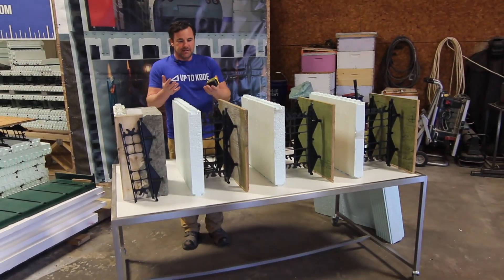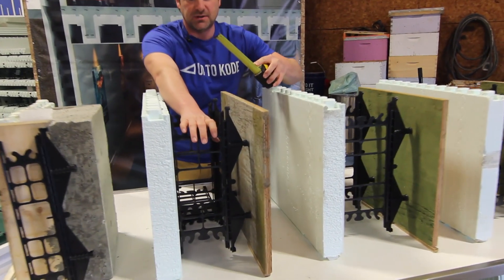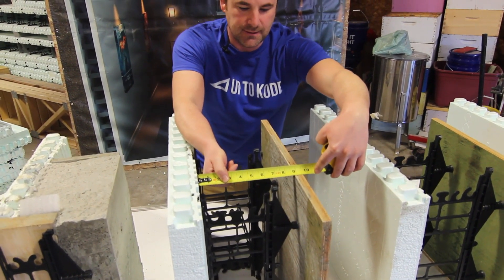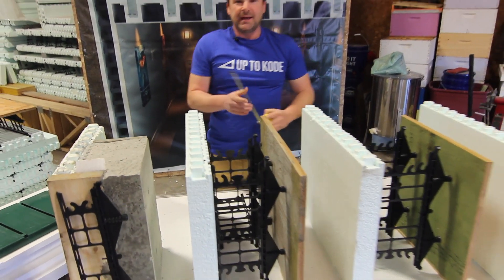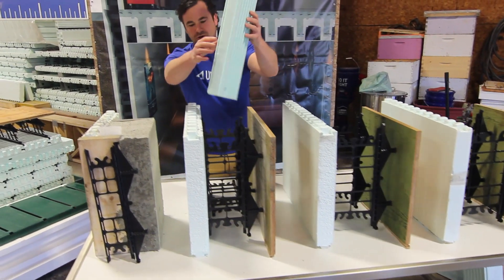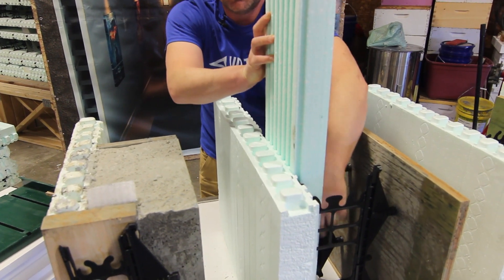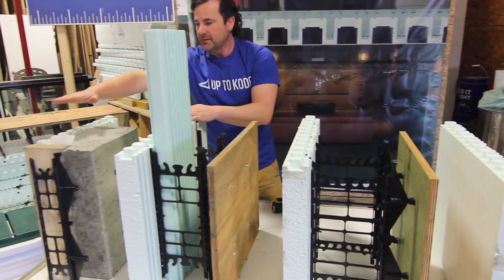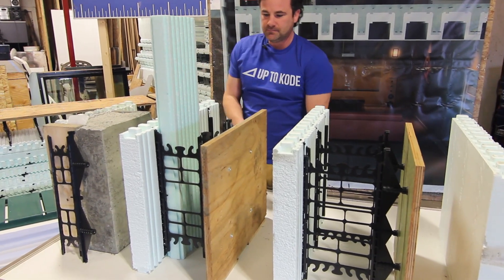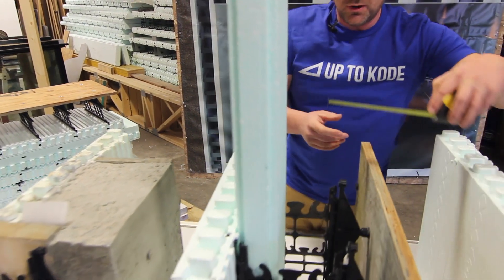The first thing you can do is, instead of buying a four-inch web, buy a six-inch web. With a six-inch web inserted into the multi-link, you now have an eight and three-quarter inch wall thickness. If you want to maintain the six and five-eighths concrete core and add insulation value, you just grab a two-inch insert and stuff that in. This assembly would have been just an R12 wall — now this one is an R20. You have an R20 and still have six and five-eighths to six and three-quarters worth of concrete.